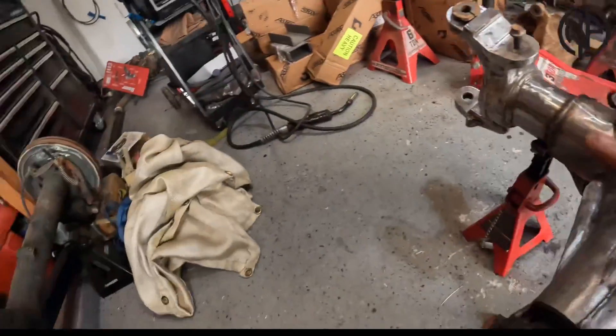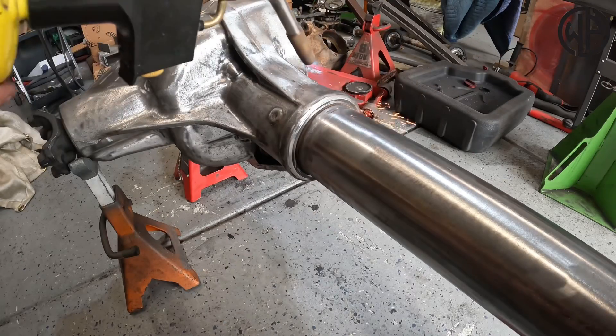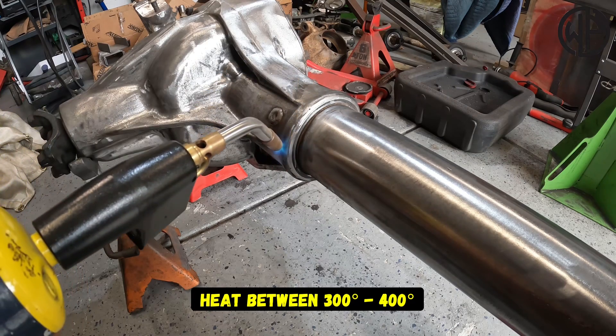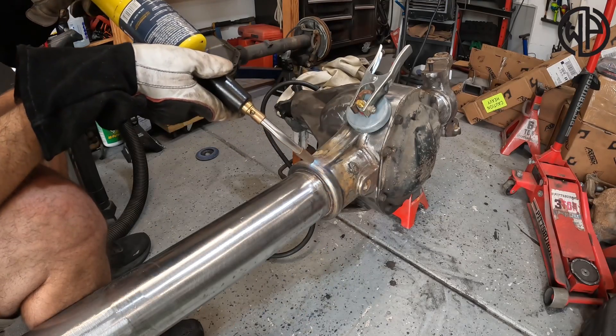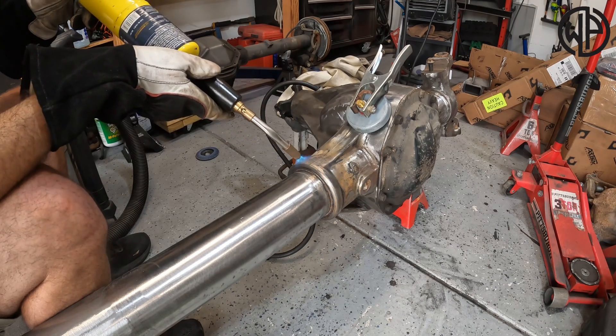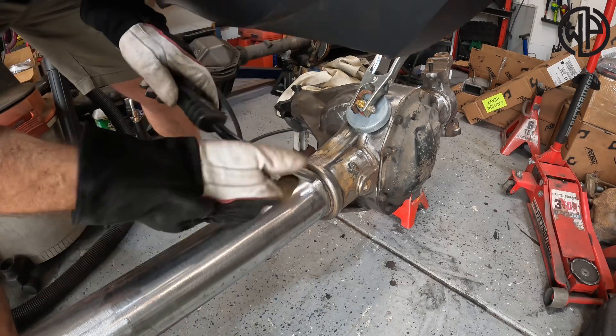We need to make sure everything stays warm and cools down together. That's where the torch comes in, or you can use a fiberglass welding blanket. On one side of this axle I used that blanket — I heated it, welded it, wrapped it in the blanket, left it overnight, and it came out just fine. But sometimes you want to move faster. Use the MAP gas torch to preheat the cast, keeping it off the mild steel as much as possible, and periodically stop to check the temperature with your infrared thermometer, constantly moving the torch and making sure your welder is ready to go when it hits temperature.